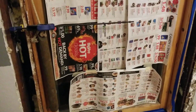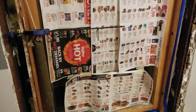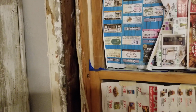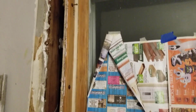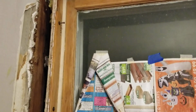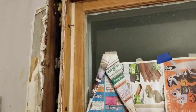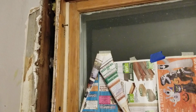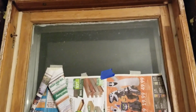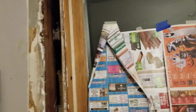What some people have done in the past is they'll cut the sash cords on the lower sash, because that's what they can get to. Oftentimes the upper sash is supposed to come down, because they're double hung windows, but they're either nailed shut or painted shut. Painted shut is more likely, or just years and years of painting. The upper sash on this probably hasn't been moved in 60 years. There's just that much paint on it. Or more.